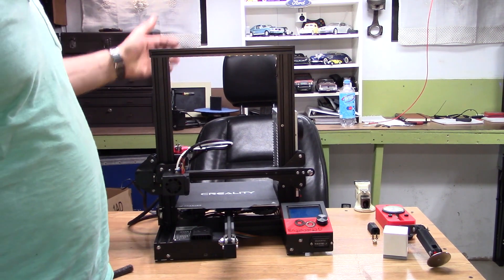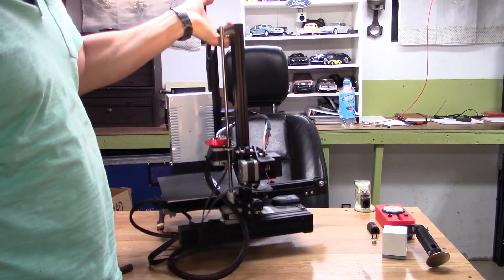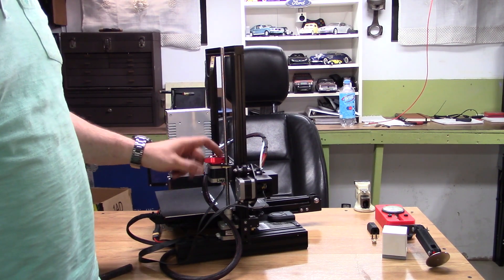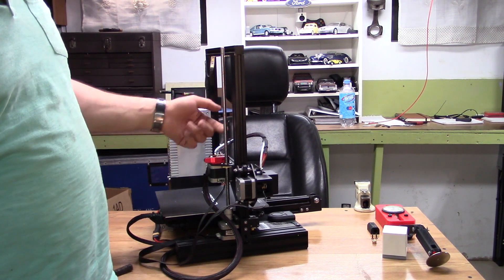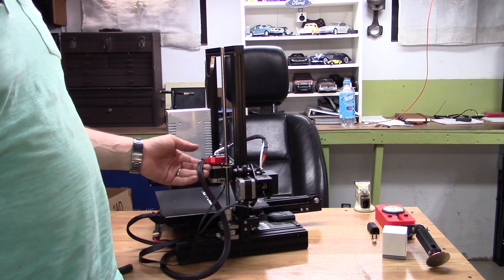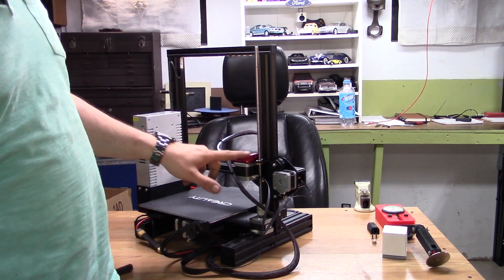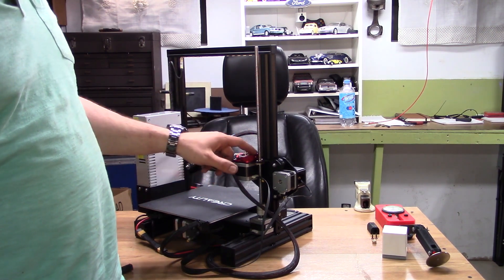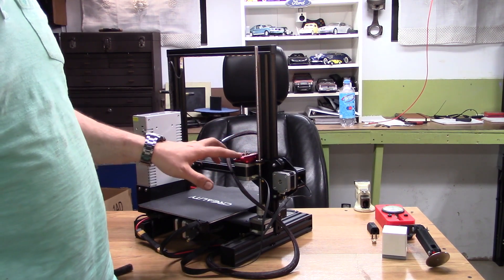One of the things to make this machine as reliable as possible: the factory extruder is not very good, to say the least. The actual arm of the extruder tends to develop cracks — mine developed cracks after only a couple hours of print time and basically wasn't squeezing the filament against the hub gear, so the printer was under-extruding severely. I bought this aluminum extruder; it's a direct replacement and it's made out of aluminum so there's less chance of it breaking.